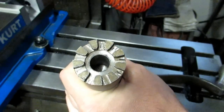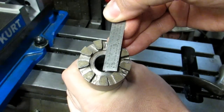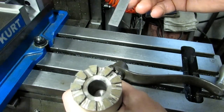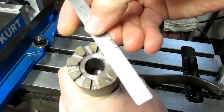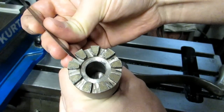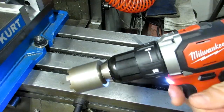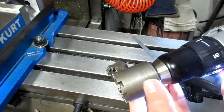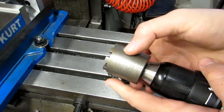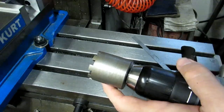On a Bridgeport the inside is about a 5/8 hole. There's a little counterbore which I replicated from the knee handle. I used a 3/16 end mill — you could get by with an eighth but I was concerned about leaving a small nub where the cutter passed. If you're going to use a cordless drill, use the low-speed option for more torque. I've since made one for the local community college and took a lot of weight off — turned it down to about an inch or 25mm — which really shaved weight.